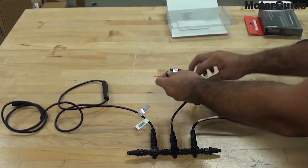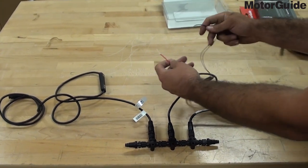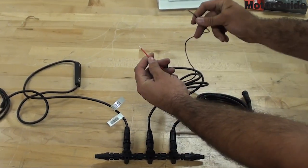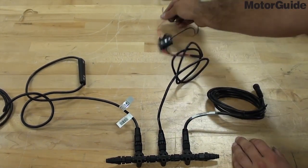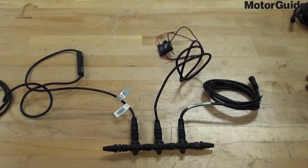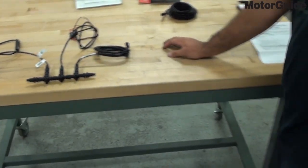You can go straight to your 12-volt battery. You'll need to crimp on ring terminals — positive and negative connection — and then you're good to go. Thank you, good luck, and have fun running your XI trolling motor.